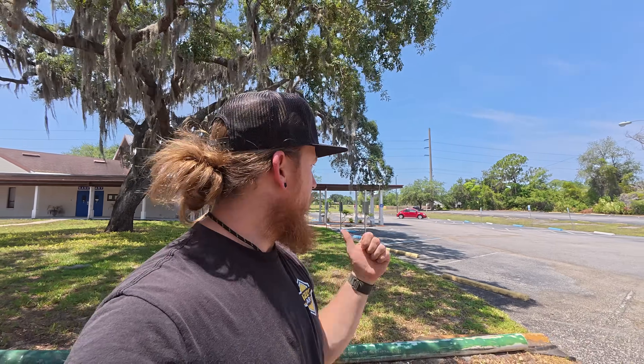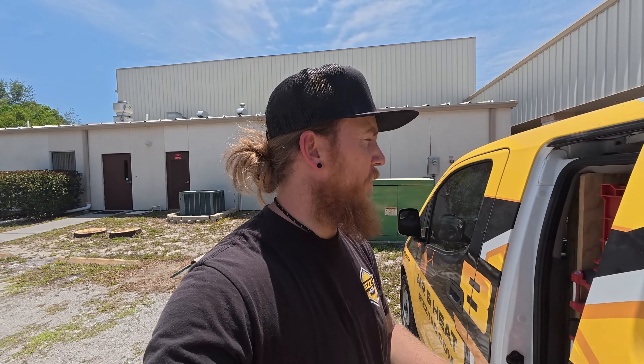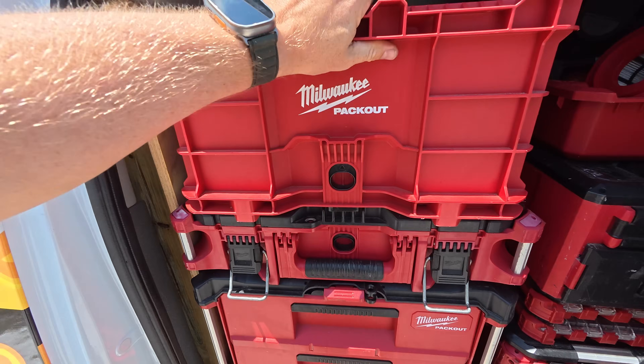Right now it doesn't seem like it's the compressor, because there was some sweat on that line — so it did look like at some point it was running, but intermittently. That contactor is probably dropping in and out. We should have some — I just stocked up on some good old Packard components: Packard Titan HD, Titan Max, all those good things. We got one.